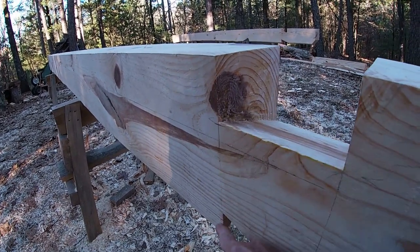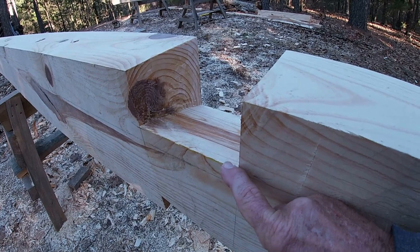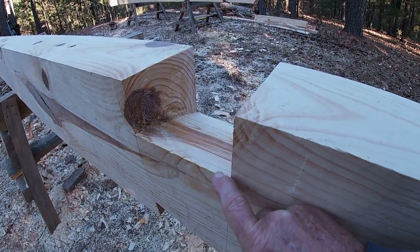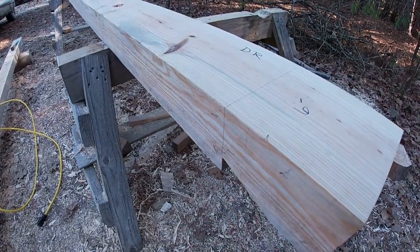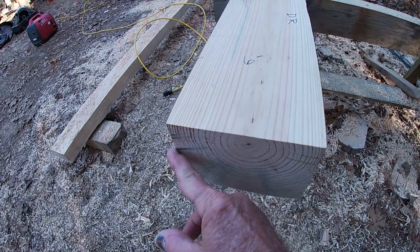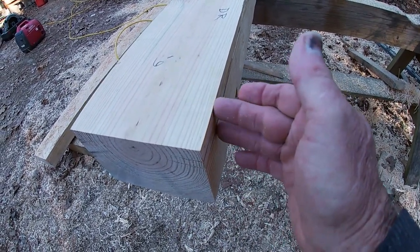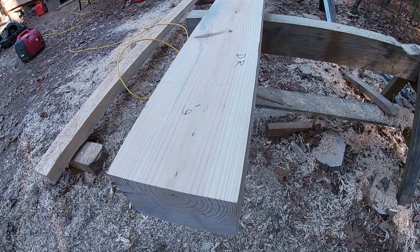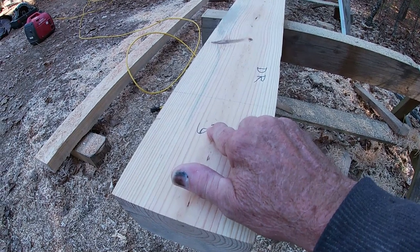I did some measuring and figured out the height that I needed out of my log up above the second floor. Since there is a three inch part left on the half log, I came up one inch from the center line to get my inside mark. After I leveled up the inside face of the half log and laid out the half dovetail and cut this part of it, I turned the log over, leveled it back up, put my level on the bottom side. I made sure this side was parallel with the inside because this will be housed in the notch on top of the plate log. After I did all that, I measured and this was just a little bit under six inches.